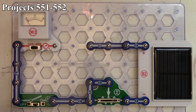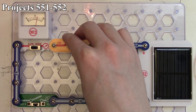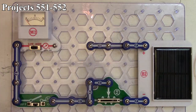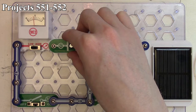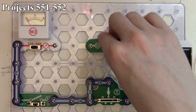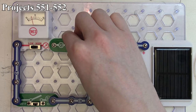A 10,000 ohm resistor shows about six on the meter — ten times as high a resistance as the 1,000 ohm resistor. With a capacitor in the circuit, it starts high and then shows less and less deflection as the capacitor charges up. Once fully charged, I can short it out and recreate the charging process — as it charges, there's less and less current going through it, which is why we see less deflection on the meter.